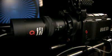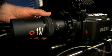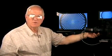We know that when on the plus side we're going to be rotating the back focus of the camera in the counterclockwise direction. First, you set the diascope to zero, and then you refocus your back focus of the camera. This is the most accurate way to adjust the back focus on digital cameras. The adjustment is guaranteed to go at least two tenths of a thousandth.